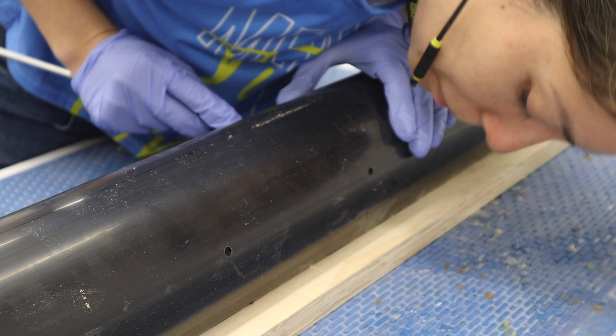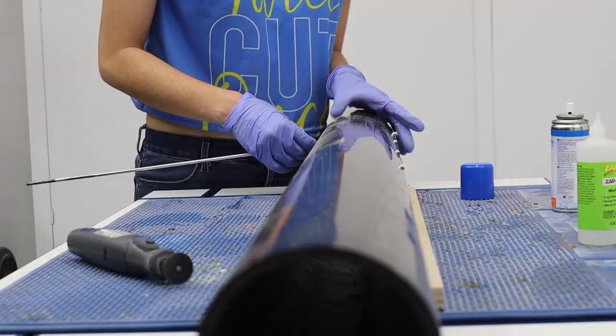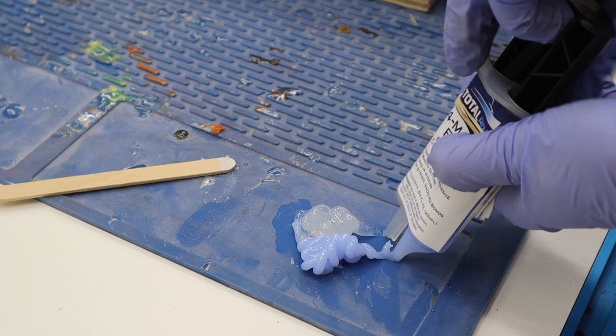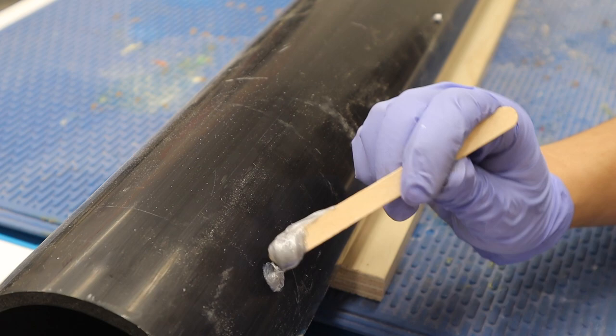Now the dowels are important because they're going to hold the pieces of wood up out of the condensation that's going to gather in the bottom of your steam box. I used little aluminum tubes that I had sitting around left over from the downwind faster than the wind cart last year, but honestly use whatever is easiest for you. I would actually maybe not recommend a tube because I had to be really careful not to make tiny little pressure chambers in there. Anyway, I tacked them down with CA glue while I cut them, and then I went in and epoxied all the ends.